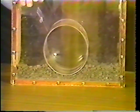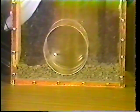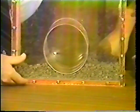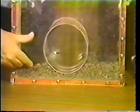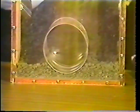Okay, now if you take a look there, Bob, you'll see that the density of the material has increased and the pipe is cradled. There are no voids, all right? That was the thing we were concerned about before when we said we did it the wrong way. Right. So we would consider this a lift. Yep, that's your first lift. All right, now our next procedure then would be to go up how far in our second lift? We would say not further than halfway. The halfway point of the pipe. That's what I would suggest, okay?